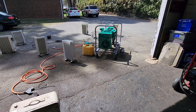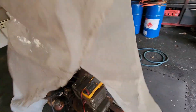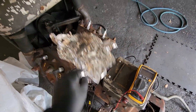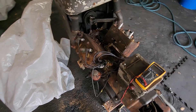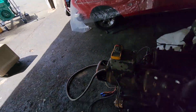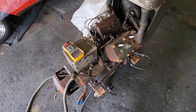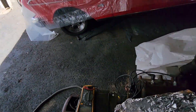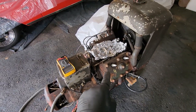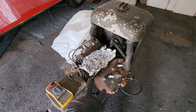I'll let it run a few more minutes off camera. Once this project's complete we've got another one in — it's not a DJC. You've probably seen the videos. I got this from Ben Trigger on the Smokestack board. This is a gem — it's a V4 flathead Onan. A quick rundown: it's got a low compression cylinder two, some governor issues, a lot of work needed. I can only work on one project at a time, so we're focused on the DJC. This will be next. It's an Onan V45.